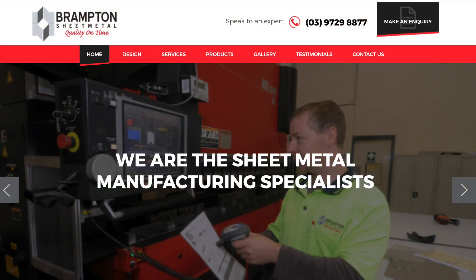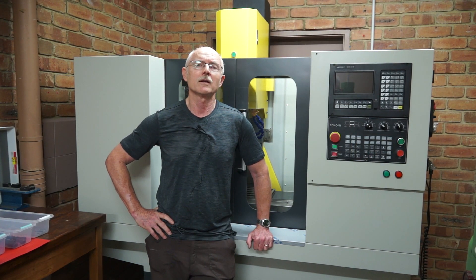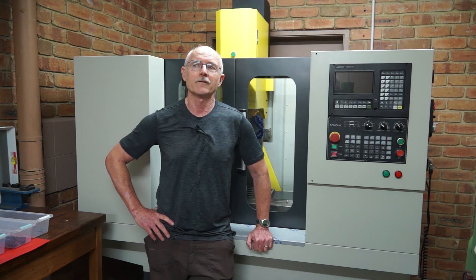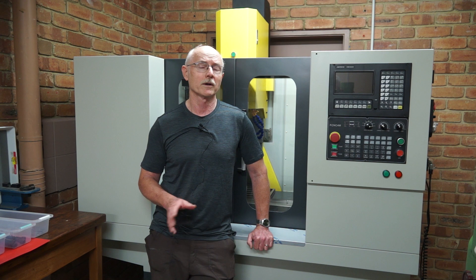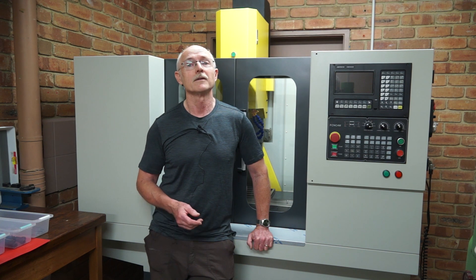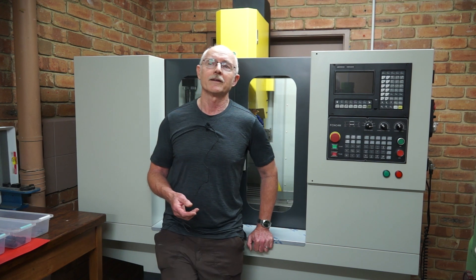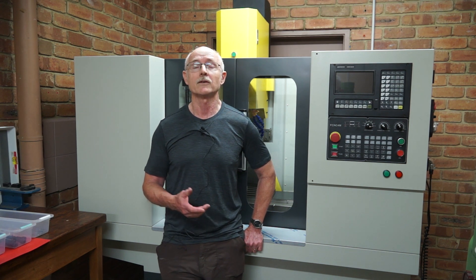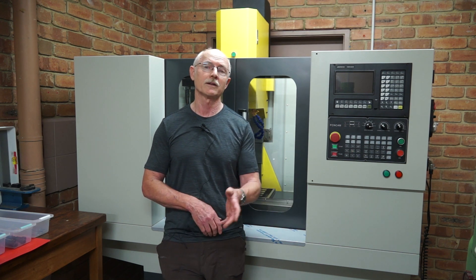Brampton Sheet Metal, and Phil Pears, was the guy that helped me a lot. They took the STEP files and did their own development and produced their own DXF files. That way the K factor, the bend allowance, and all those parameters — they took responsibility for that, which was quite a unique approach, because most sheet metal contractors want a DXF file. I was happy to give them a DXF file, but I asked them about the K factors and I was told you'd be better off just giving us the STEP files and letting us do the development. All the information's in the STEP file, and that's better for me too.